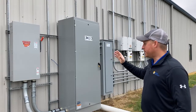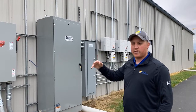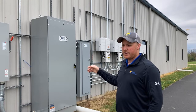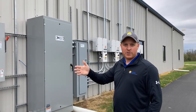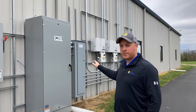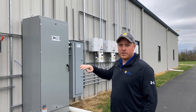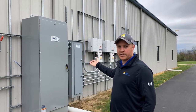Then as you go down the line, the next box you come to is a relay cabinet. On this particular project, we had challenges integrating with both the old building and the utility outside. The utility at this facility required a redundant protective relay to turn the solar project off in the event there was a problem on the grid. For example, if you had a car accident out on the grid, you wouldn't want to back-feed the grid and injure first responders trying to fix the problem — you'd want the system to turn off. Now, the solar inverters do that automatically; however, at a certain size you want a redundant piece of equipment for an extra level of protection. In this case, we used a relay specified by the utility, and we built a custom cabinet to house it. That relay will then trip the main solar breaker and turn the solar project off in the event of a problem.